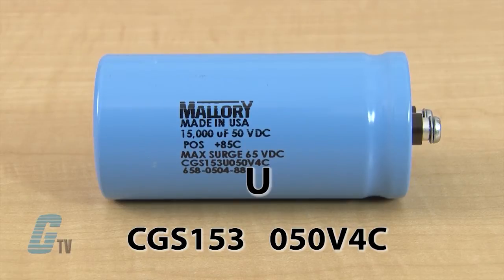The next mark is the capacitance tolerance and is represented by a U, T or M. The U is minus 10 percent and plus 75 percent with 6.3 to 150 volts DC. The T is minus 10 to plus 50 percent with 151 to 450 volts DC, and the M is plus or minus 20 percent.